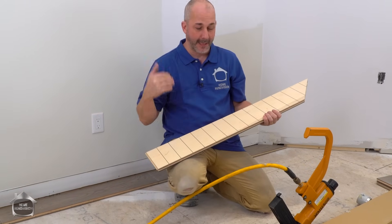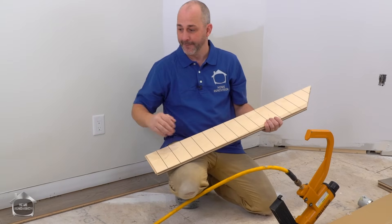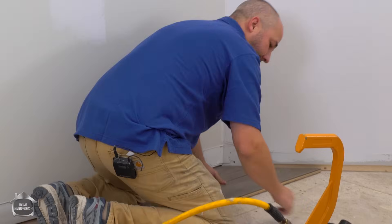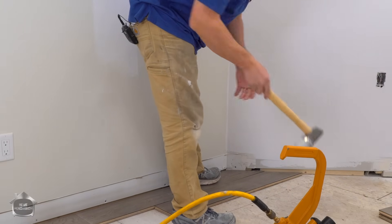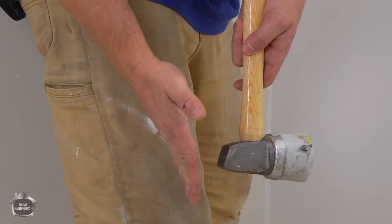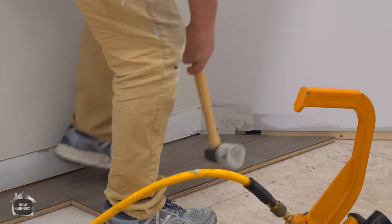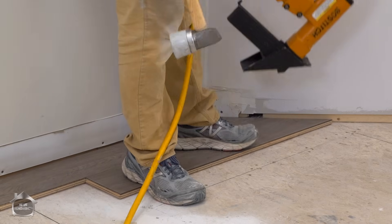In new construction, our OSB subflooring is glued and screwed to the floor joists, so we don't have the same wavy-floor problems as with dimensional lumber. We can install this in whatever direction is aesthetically pleasing — even if it's not running contrary to the floor joists, this is going to stand the test of time. To install, line it up and take your rubber mallet. The rubber mallet is used for impact to drive the staple; the sloped backside of the nailer guarantees the point of impact is beneath the tongue, so you'll never risk damaging the wood.